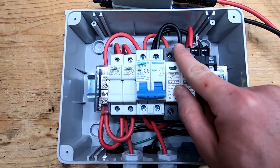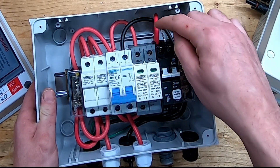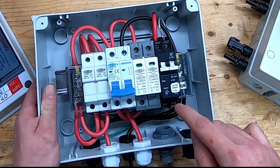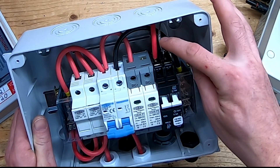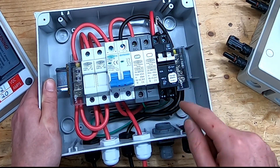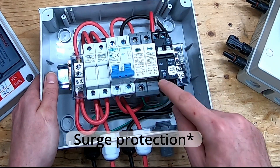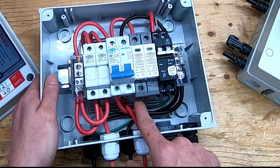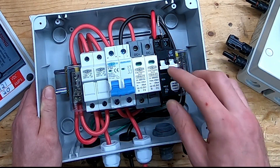For the rest of this video you're not going to see this jumper cable — I just added it in during the editing process. For the ground fault circuit interrupter, don't get disillusioned by the negative sign — follow the instructions. The positive comes in here and then the positive comes out, so this is going to be my main positive. For the GFCI detection, you have your battery or solar array negative that comes around — I have it underneath these two black wires in this terminal block — and then the ground wire comes in, loops around, and connects into the ground for my overcurrent protection.